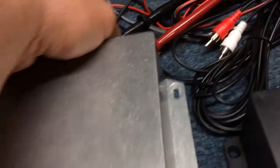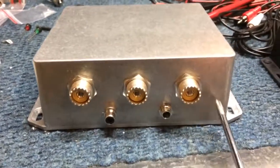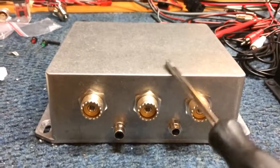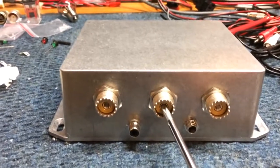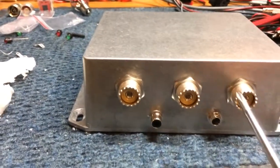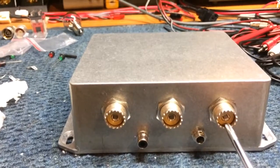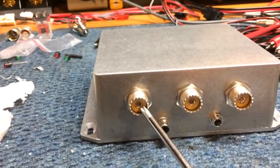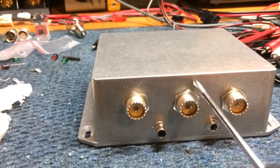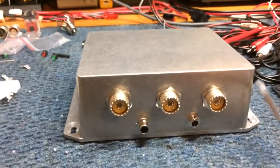This second box is a fully shielded die-cast aluminum box. We use high-quality American-made Amphenol SO239 connectors — they're more expensive, but you get what you pay for. There's a heavy-duty sealed relay inside. Here's your common antenna input. This connection is your transmitter port and this is your receiver connection. When you ground the control jack — shorting it to ground — the coax relay switches over to the transmit port. When it's in the receive position, the transmitter port is fully grounded; in the transmit position, the receiver port is fully grounded, giving you optimal isolation.